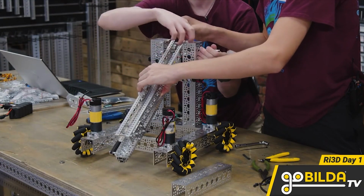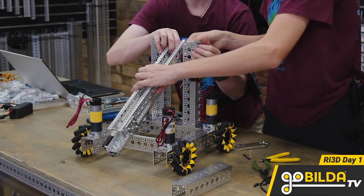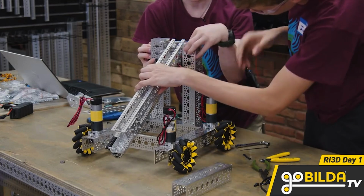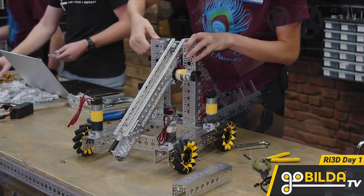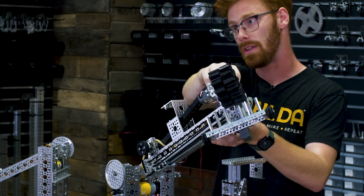Now moving up from that drive base, we started by just taking a copy of this scoring arm and bolting it to that Strafer. That meant we had the same 51-to-1 motor driving a 5-to-1 gear reduction into these mini low-side channels. This is a super solid arm system, and that motor ratio is really appropriate for even the extending intake we put on the end of this.